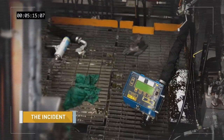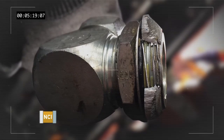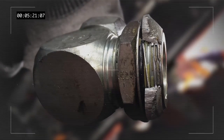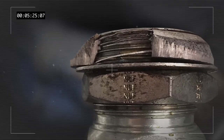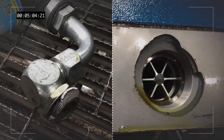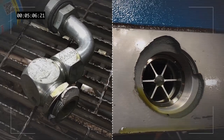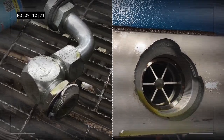The maintainer was in the left-hand pump bay, adjusting the flow meter load. The side housing of this flow meter failed, allowing the fitting and thread for the delivery line to blow out the side of the flow meter. On the left-hand side of this image, you're able to see the 90-degree fitting, and on the right-hand side, you can see where that fitting has broken away from the flow meter.